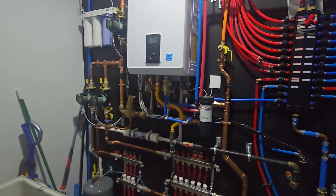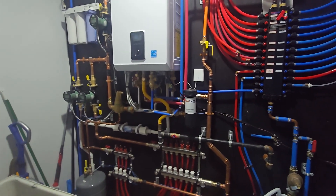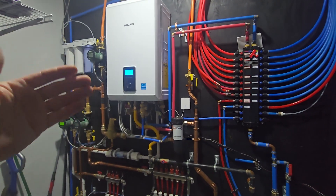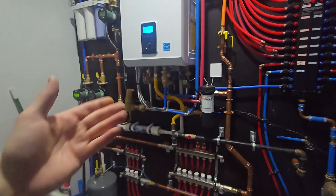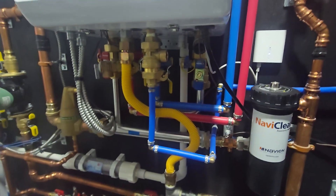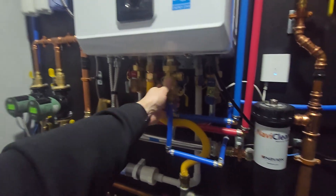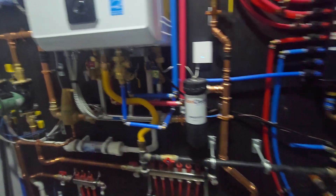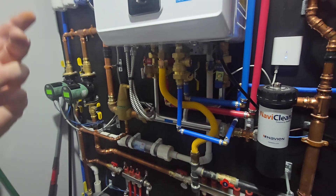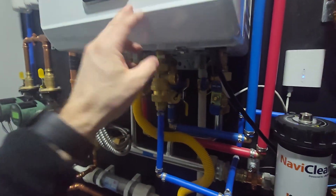What you want the system to be filled with before you turn on the boiler and start heating things is usually around the 12 to 15 psi range. This Navien system will automatically regulate that pressure at 12 psi. This boiler has what's called an auto feed, which will automatically fill the system — it may not purge all the air, so you may still have to manually purge things. When you initially start up this boiler, it will take the 55 or 60 psi city water pressure, fill the system, and as soon as the boiler registers 12 psi internally, it's going to shut off that water supply.